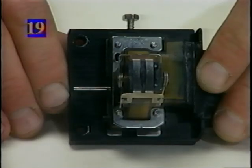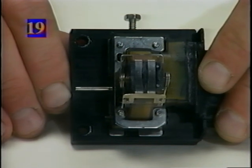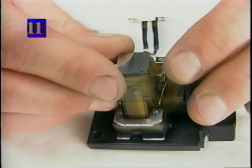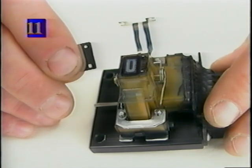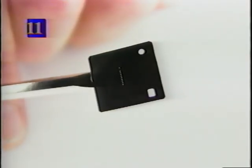The most common cause of poor print quality or fuzzy characters is a dirty or worn array plate. Over time, ink can build up around the small holes in the array plate. If this occurs, it is best to remove the array plate and thoroughly clean it by soaking it in a container of Codeck solvent and then wiping it with a paper towel. If the problem persists, the array plate should be replaced.